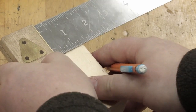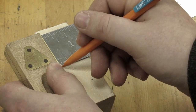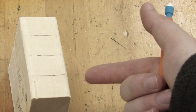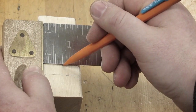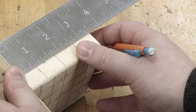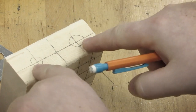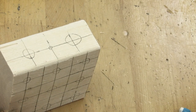Like we did before, I'm just going to run these straight across. Now I need to mark three quarters from a face. Set my tri-square up here — three quarters is twelve lines, and the longest line in between the half inch and the whole inch mark is three quarters. I'm going to run that straight across. What I need: big circle, tiny circle, big circle. These two holes are going to be for marbles; this one's going to accept the screw. That'll help us keep track of what we're doing. And that's it for that step.